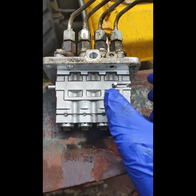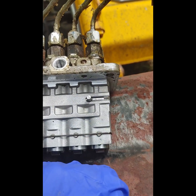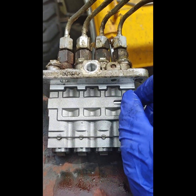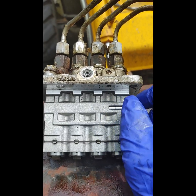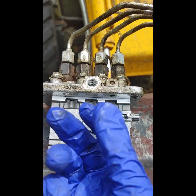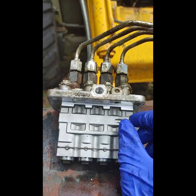But before I did that, I was looking at the rod here in question. Okay, so this is the lever. You can see it clearly says stop with an arrow pointing that way. So that's the stop, no fuel position. And that's on or run, right? And I noticed when I was moving this back and forth that it was binding a little bit. Now, I think from the videos that I've seen, there's actually a rack of teeth on the back side of this, and that rack of teeth actually engages a barrel-shaped device in these injector ports here and rotates it to probably shut the fuel off.